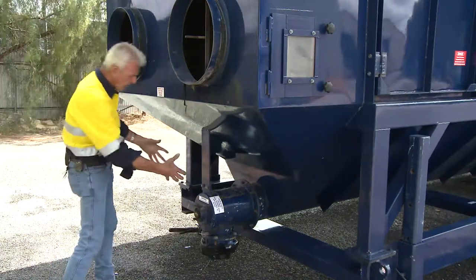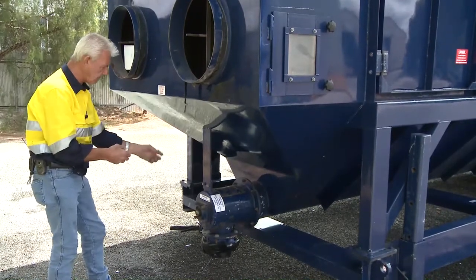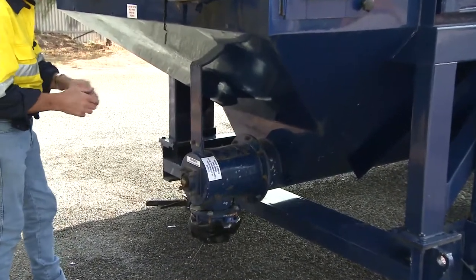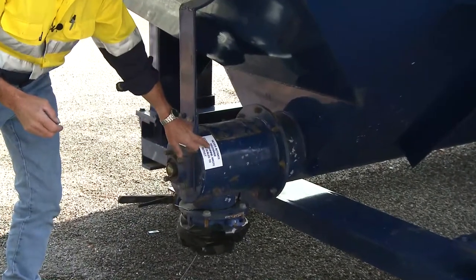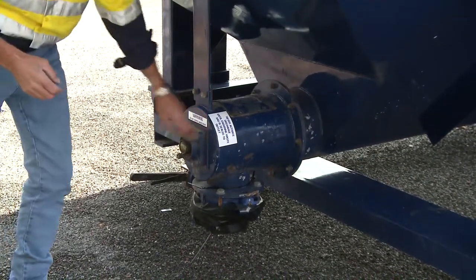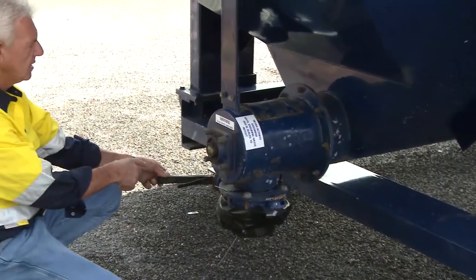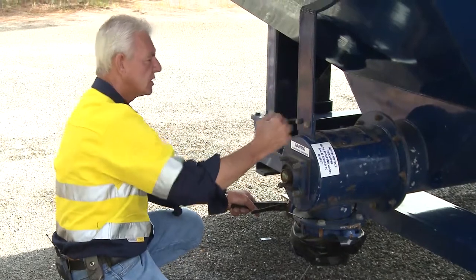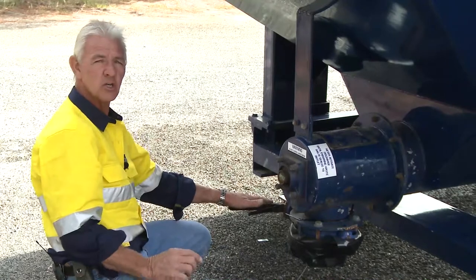This round drum is the end of the pilot drive of the auger — this is a bearing, and the auger is suspended inside this housing. There are always notations throughout the machine to alert you to requirements. One reads: never activate discharge until ensuring the waste bag is sealed to the outlet. We have a butterfly valve here that keeps this valve closed, because you're sucking air through — you don't want to create a vortex by leaving it open. This is closed during operation.